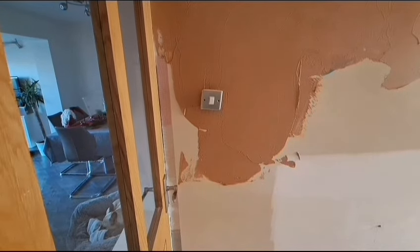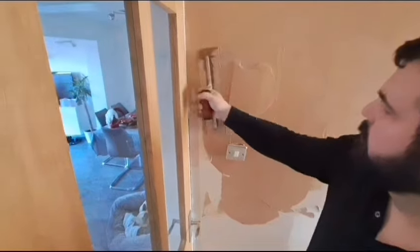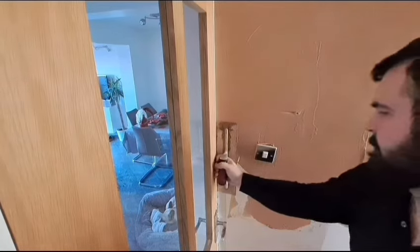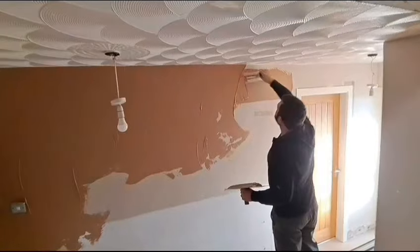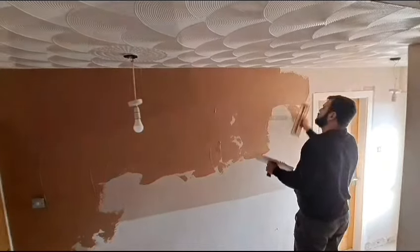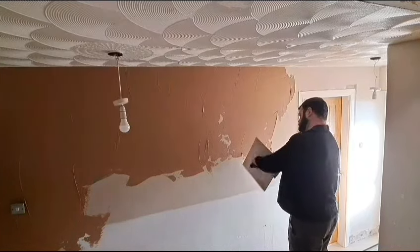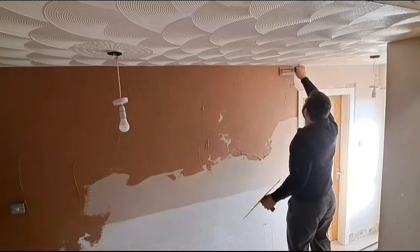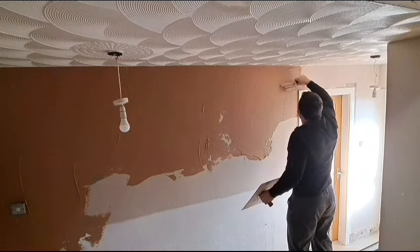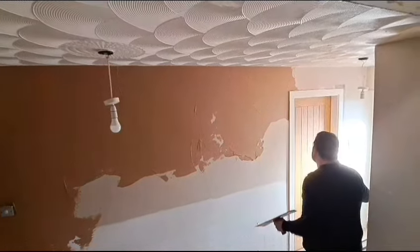You can see the scrim that we put over the crack down the side of the doorframe. The doorframe's been screwed solid now by the joiner, so that won't move. We're just filling in around it, and you always start from the top and work down. The toe of the trowel is the front — that doesn't leave a line, but the heel does. The toe just covers over where the heel was, overlapping just a little bit. This is the same through every single stage of the process. For your first coat right now, I'll give it a second coat and it'll be the same process — first trowel, second trowel, third trowel, and a polish. Exactly the same each time.